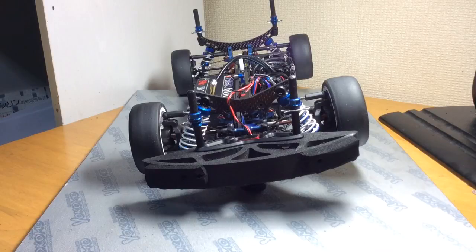In this video I have the tires on just for demonstration reasons. But ideally, take the tires off, because the tires are not the same weight left and right. I bet most of these tires here are probably not the exact same weight. So take the tires off, so you just have the axles and the electronics and the chassis — no tires.